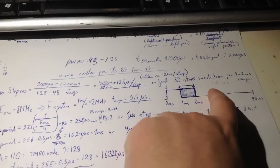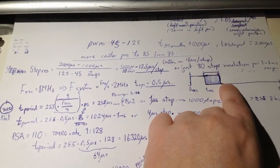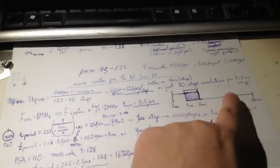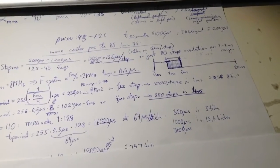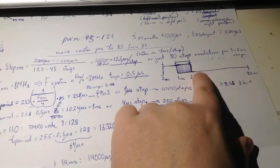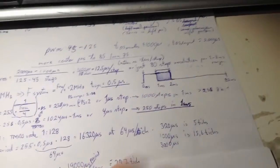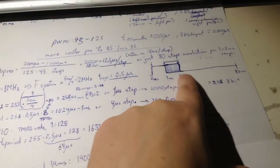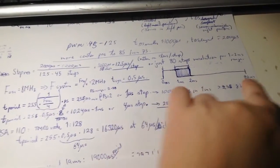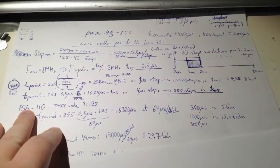What about the time here? Shall I just set it to 255 and let it repeat? So what I did, I didn't want a lot of interrupts here because it slows down the program. Or you can do that if the interrupt service routine is too large, because then you get a lot of overhead. So what I did, I slowed down the timer by increasing the prescaler.